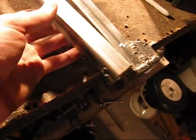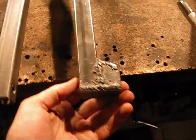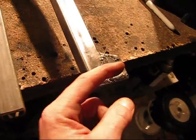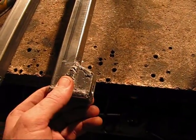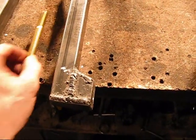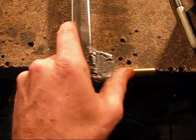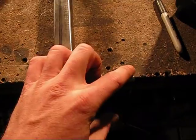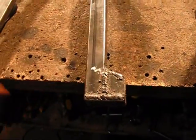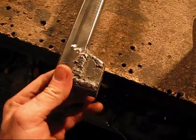Five-eighths inches from the edge, five-eighths inches from the edge. Just got those drilled. The reason I waited before putting these holes in is that if I drill the hole and then weld it together, I'd play hell trying to stick the bolt through because the holes wouldn't line up. Or if I drilled the holes and then put them together with a bolt through and welded it, the splatter from my flux core would get on the threads. I've done both before, so I've learned from my mistakes — weld it together, then drill the hole.